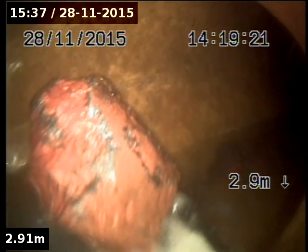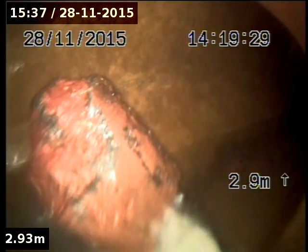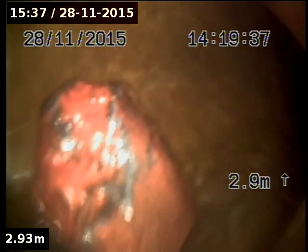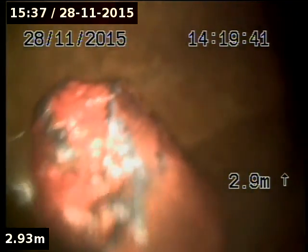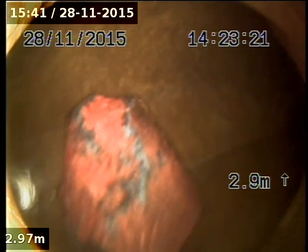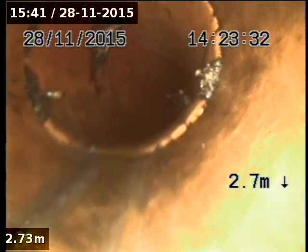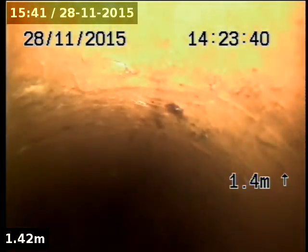Let's give it a flush test. Coming back - so we're out the main, coming back. There's a little bit of tree root there, just on that joint. Coming back further, just about to hit the cast iron trap now. We're dropping in and under the trap and through.